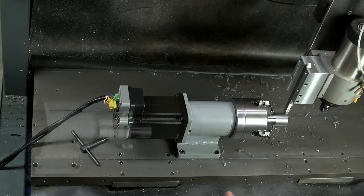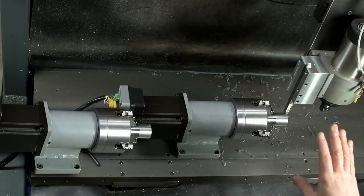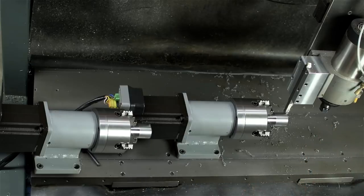So the fourth axis used to be mounted on the end there. That's ideally where it would live. I'd want to pin it in place, bolt it down so it's nice and repeatable. That gives me the maximum turning length and potentially the maximum number of tools on the Z-plate. See, this thing, more often than not, will be doing aluminum probably. The occasional funny shaped piece of steel, but mostly aluminum.